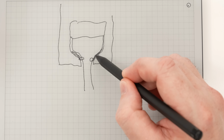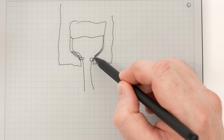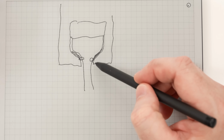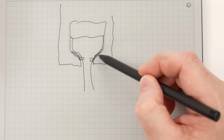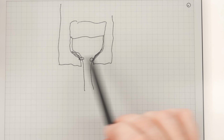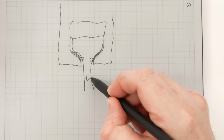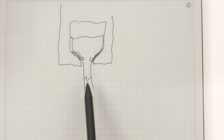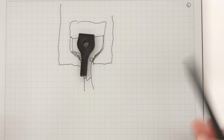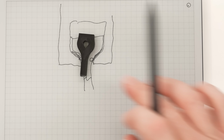But if the stress starts to build up on a point like that, which I'll of course radius to try to prevent that, the material will start to move and the bearing will actually move up and spread out across this entire piece. Hopefully that will be enough to cause this to fracture down in the neck down region of the sample, which is what I want. I want them all to break like this. But let's design something and see what happens.